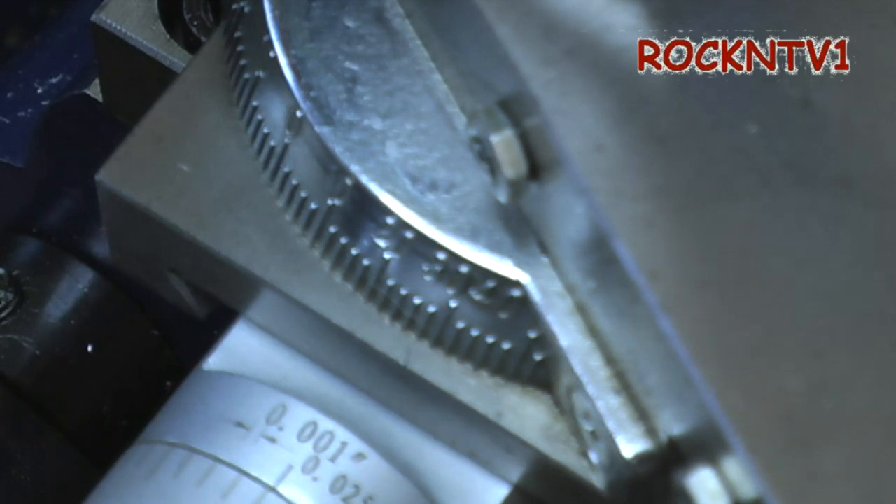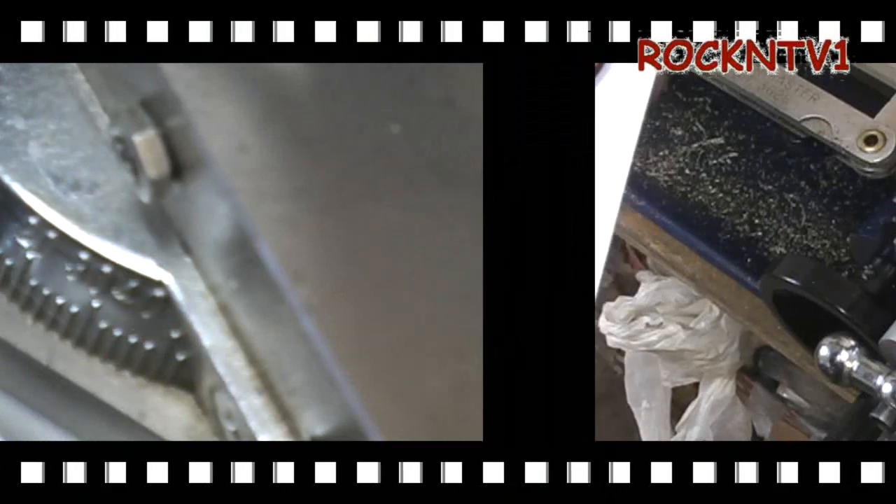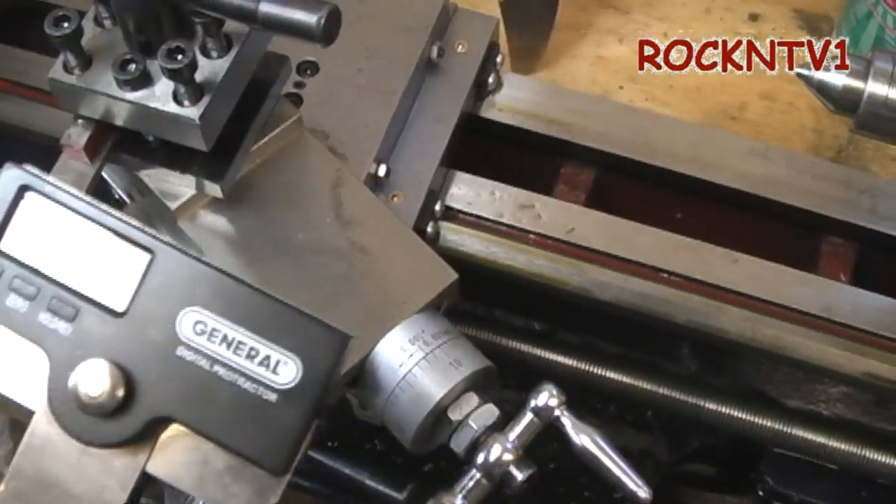I'm not sure that all of that actually matters once it gets pretty close, if your threading tool was set up to be a 60-degree tool. You guys watching this already understand the deal about the angles. But if you're trying to do it quick, it's kind of hard to see. I personally don't have a need to do this at hyper speed, so I just want to show you guys this protractor.